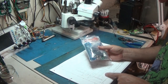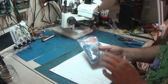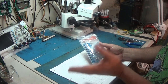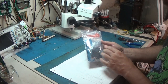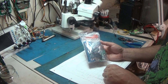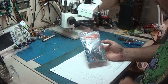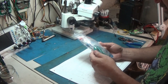And I noticed that some of these, like the coin switches and stuff, are wired kind of old school to where they're using the normally open, normally closed, and common on these. So I bought some micro switches to wire that up. And I bought a few extra because whenever I'm doing harnesses, a lot of times I am scrambling for micro switches. So I bought a few extra. And I bought a bunch of, like I said, the wire, just because.